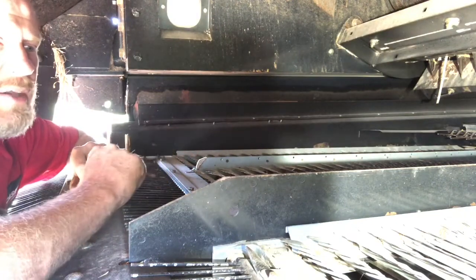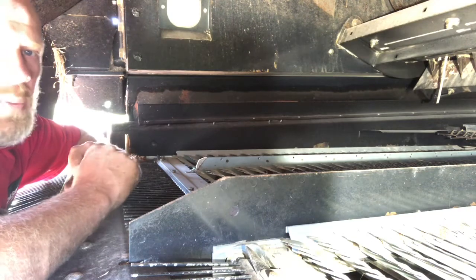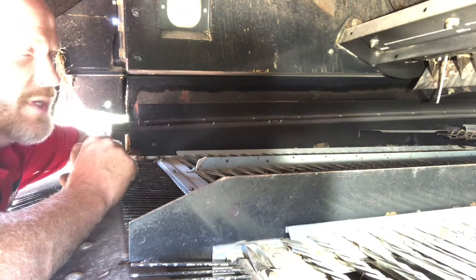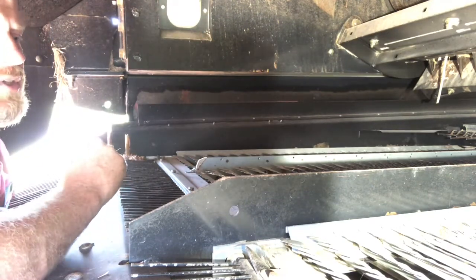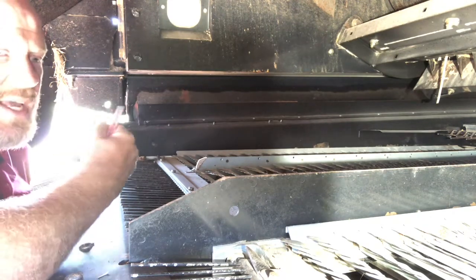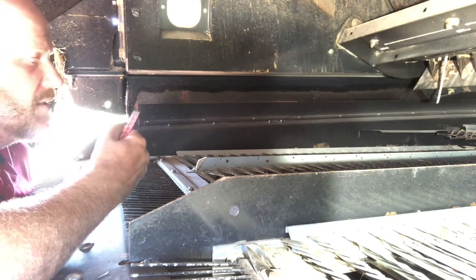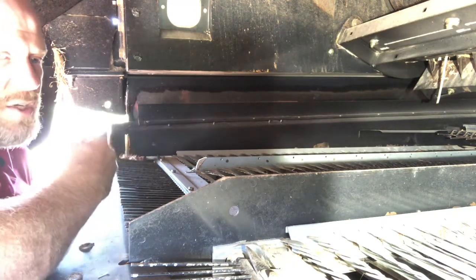So when we calibrate our sieves, it tells us in the display or in the operator's manual to close that sieve all the way down, open it back up to 6mm, and then we go in the cab and calibrate it. The important part is that we close it all the way down first — that way we're opening it up as we go to 6mm. We're taking any slack out of the linkage as we open the sieve up, which ensures that when grain hits the sieve, there's no slack in the linkage that's going to close it down.